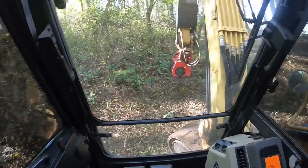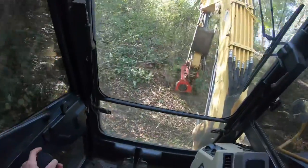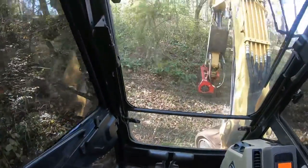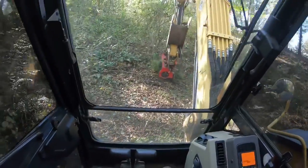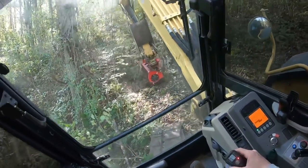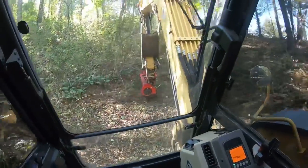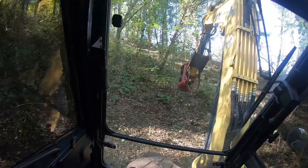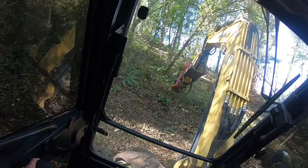And if those tracks slip a little and tear the ground up, you're going to have to reach out and use the boom to move yourself. Because you've torn the ground up and you got down to bare ground and you filled your cleats up also with debris, dirt. And it's hard to get going, which I'll probably get to demonstrate here in just a second.